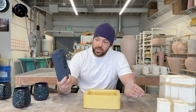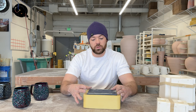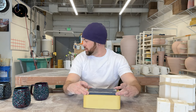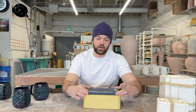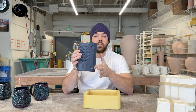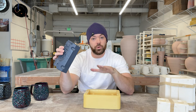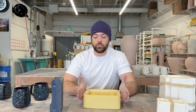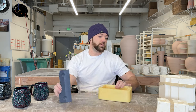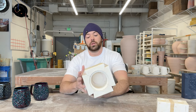What I've done this year is changed over to Vitaflex 60, which is a lot firmer. The master molds and mother molds are now designed so I don't have to flex them to get the pieces out. I'm using compressed air to pop them out. The two sides have a little bit of a draft angle — I think it's like one or two degrees — but it's just enough that a blast of air will push the plaster out without having to deform the mold, so the pieces meet up properly. That has led to a lot better plaster mold.